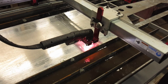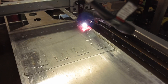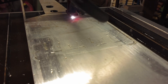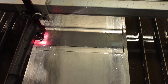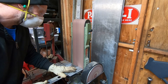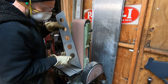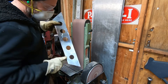All this 1/8-inch aluminum is actually salvaged. I bought five more sheets the other day for about $20, just a fraction of the cost of buying new. This is the same stuff I used on the quad truck to build the dump bed and front fenders — salvaged from my work. These are old snowboard molds; they get damaged or the model changes and get recycled, and I can buy them cheap. The aluminum cuts a little different than steel — it has a bit more slag I have to grind off — but it's super nice to be able to program something and have it cut duplicate parts identically.